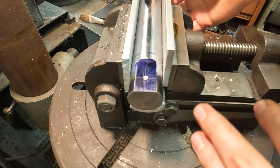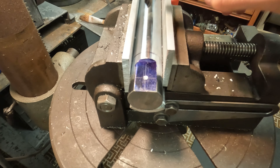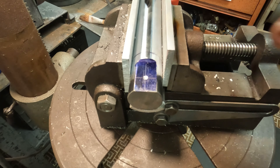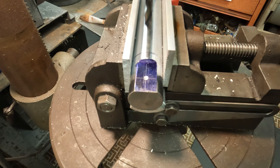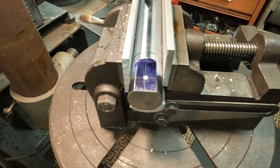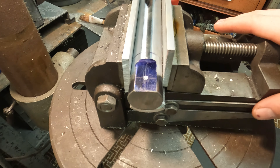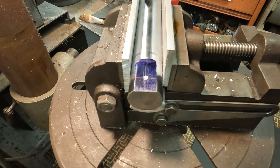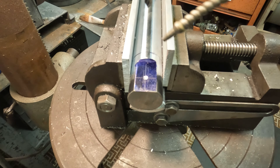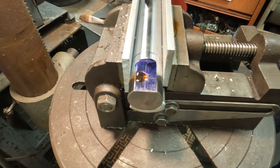Now I've got the rod set up in the drill press. I've got some aluminum protecting the chrome on the rod so that I'm not scratching or damaging it — you can use copper as well. I've got it spotted in right now. I'm going to drill a pilot hole and then my final five-eighths hole while supporting the other end of the rod with my hand. If this was on a mill, you could use machinist jacks, but I'm just using a cheap drill press and cheap vise here. I'm going to use some cutting oil to keep the bit lubricated.